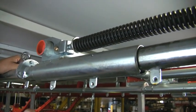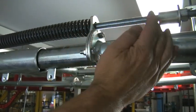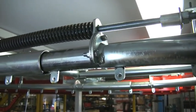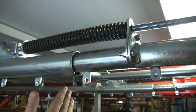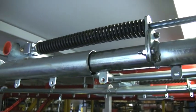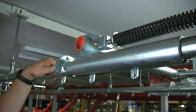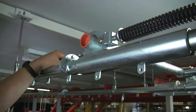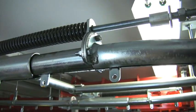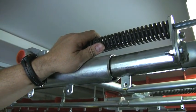When do you run into problems with the take-up? When this section is reaching the end — if this little tab were right at the end of this threaded rod, we'd basically be at the end of its travel. The only thing you can do at that point is collapse this take-up unit by screwing these shipping nuts back in. Simultaneously, you go to the nearest track inspection section, take the cover off, pull the chain out, disconnect a section — say a foot of chain — then reconnect it and move those shipping nuts back out. As you do, the system will find its new location. From there, you use this nut to give the spring the proper amount of tension on that curve.